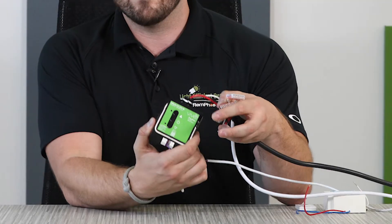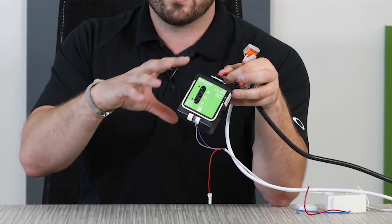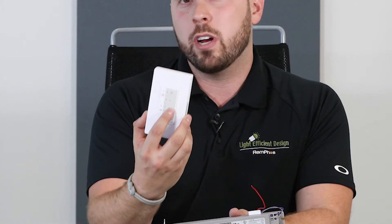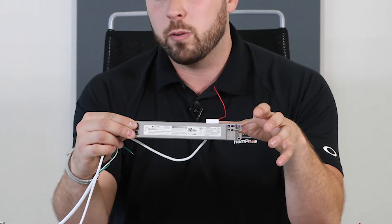A few of the solutions I have here on the table today: we have a Lutron system — Lutron uses an RF connection for wireless — and we have an LG system that uses Zigbee. Lutron calls its wireless system the Vive. Here's one of its power packs, which uses a radio frequency protocol to wirelessly group fixtures together. Lutron is obviously a very well-known name and we can help embed the Lutron technology into any of the fixtures or retrofit kits you order from us. On the other side of the table is our LG system, which uses a Zigbee protocol. There are a number of different components included in the kit, including a wireless battery-operated wall switch and a Zigbee-to-analog transformer to make our kits compatible with the Zigbee technology.